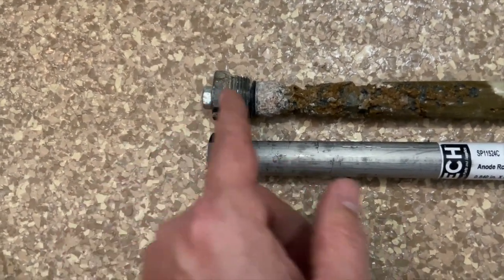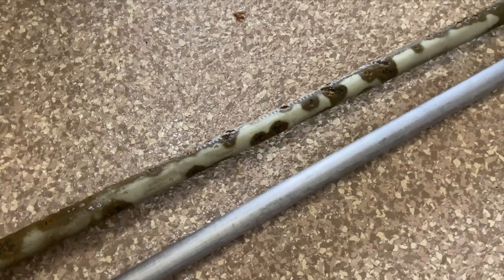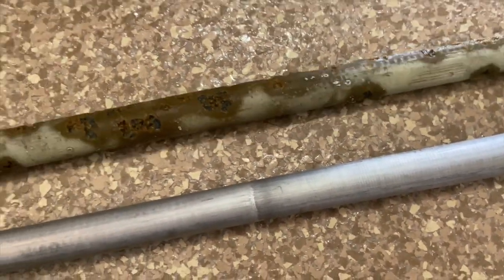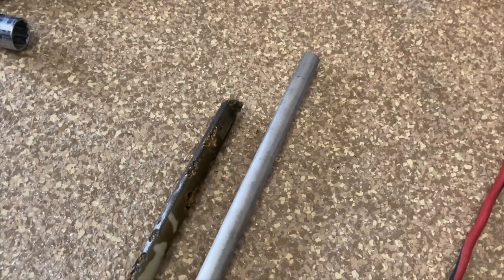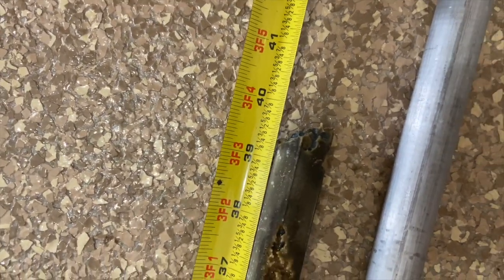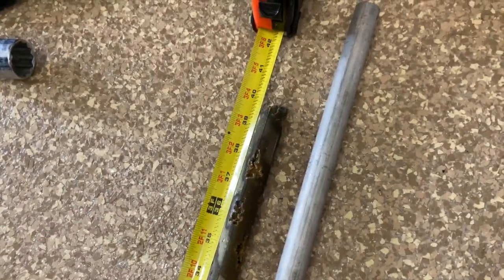It's my understanding that the water heater sends a signal through the wire, and once the wire becomes exposed that's when it tells you the anode rod is bad and needs replacement. This one might be able to go a little longer — a couple more years — I'm not sure. It doesn't look completely eroded and terrible, but given that it is pitted pretty deep in some areas, I'd expect that sensor to go off pretty soon. You'll also notice that the new rod is longer than the old one, so I'm going to cut it down. To measure, you go from the top of the nut all the way down. The part number that was in there was supposed to be 39 inches; this old rod is probably about 39 and 3/4 inches. The new rod I have is 44 and 3/16 inches, so I'm going to measure from the top of the nut down to 39 inches, mark it with a Sharpie, and cut it with a hacksaw.